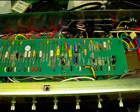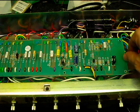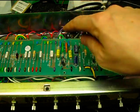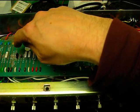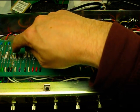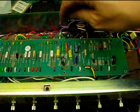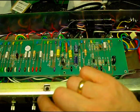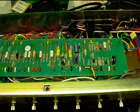Okay, so I've pretty much finished up this Bluesbreaker amp. The chassis still isn't seated, but I've put everything back together and changed a couple of little tiny things. Changed the mix resistor bypass cap to a Silver Mica 470, and changed the output coupling caps to a lower value. And we're now playing the amp on two, and it's delivering.